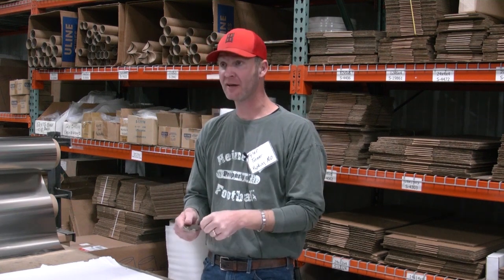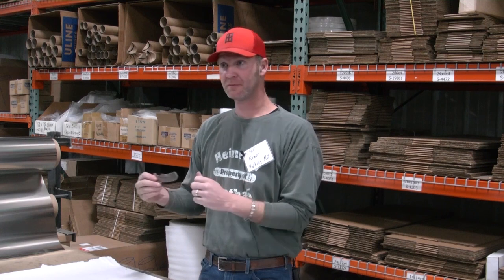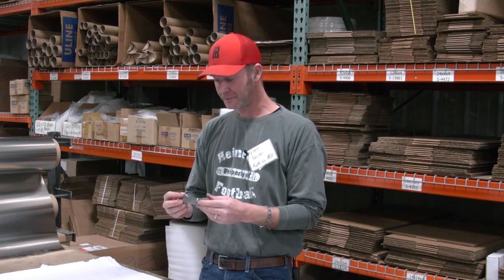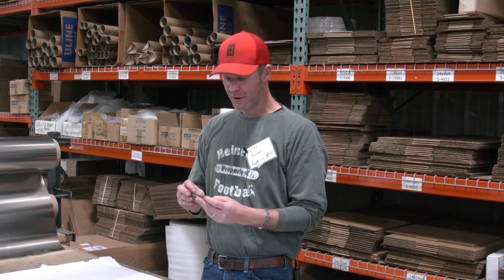I like a real thin lock bar cutout. Some guys use a 16th. It's just whatever you prefer. Then you just move that along, be real careful, cut that out, and cut your top out after that. Once you get that done, it'll be time to relieve your liners for your lock bar. And I've done it without a mill back in the day, before I had one.